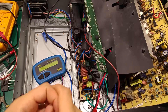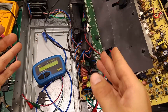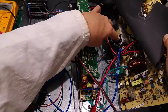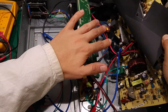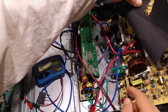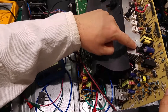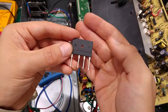After a little more investigation: I tried the fuse and it blew again, so that wasn't the cause. As you can see, everything is open. Next I checked the capacitors — I checked both the ESR and the capacitance and they were looking fine. I tried the diodes in that section but they were also okay. Then I went to the other side and there is a main bridge rectifier which has a very interesting form factor.